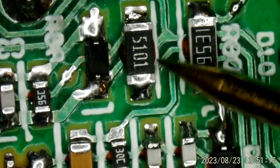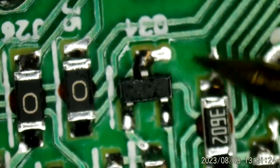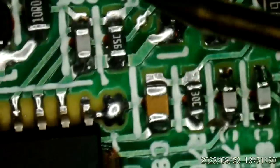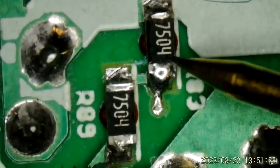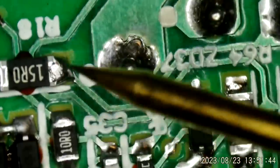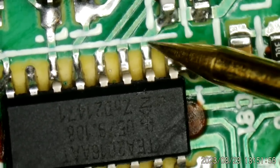And this other path it takes is over here to this MOSFET. And what turns this MOSFET on? Well, let me just say, the purpose of this is to keep your boost voltage at 395 volts, plus or minus a few percentage. Pretty tight though, 395 volts. That's the purpose of it. And that connects through a zener to ground to limit it to pin 2 of this IC. But another feature of this chip is if you pull this to ground, it's a shutdown signal.